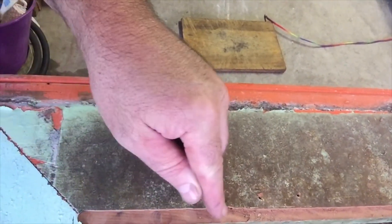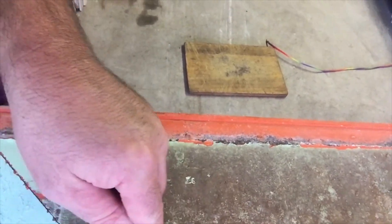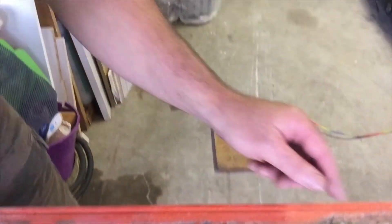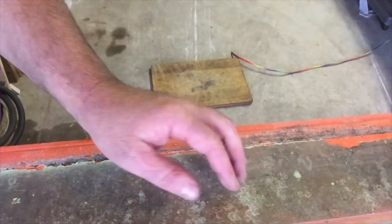So this is where I was going with the direction of rotation of the cutter — it's kicked a bit and I've got less control. And this is going against the direction of rotation — I've got a nice straight line and much more control.